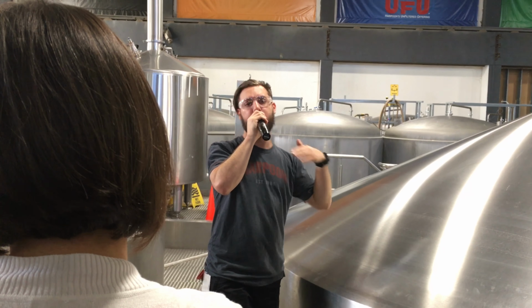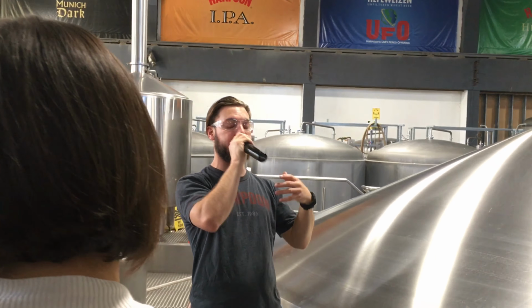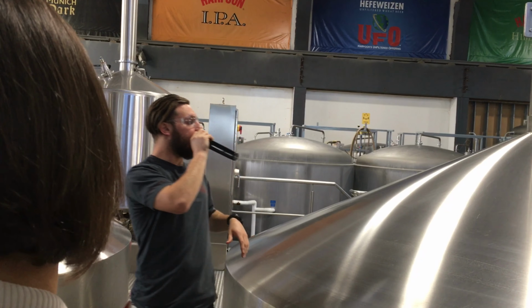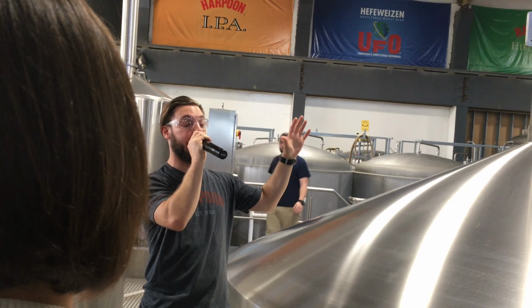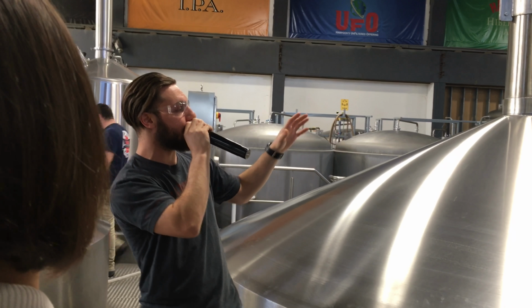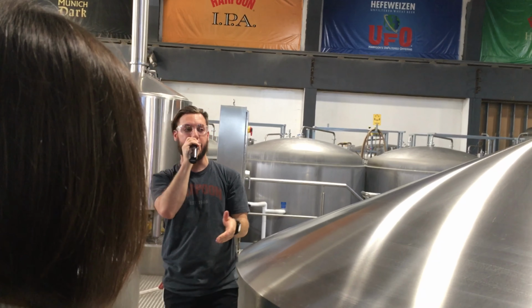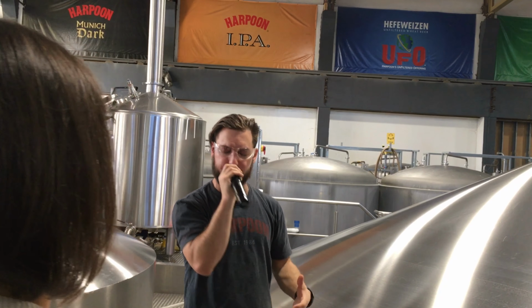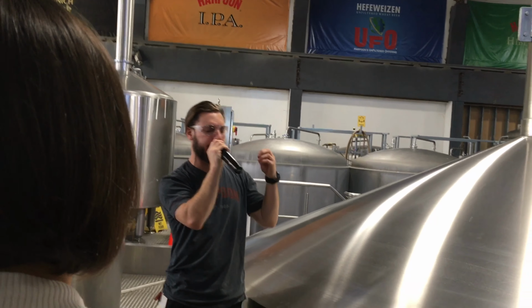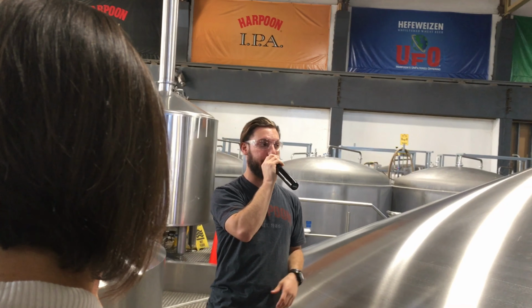So conditioning comes next, another 7 to 10 days. Let all those flavors develop, dissipate, let it all settle out, and produce all the flavors and aromas that we want from your beer. So another week and a half, we cool down, excuse me, it's not wort, it is beer now, we cool down to 29 degrees. All those fermentation tanks have glycol jackets on the outside, which crash cool the beer down to 29 degrees, and then we let it sit in that conditioning phase. We can dry hop the beer again at this point as well, directly injecting more pelletized hops to add some more flavors and aromas.